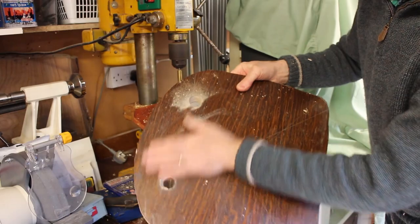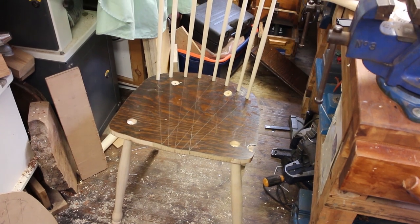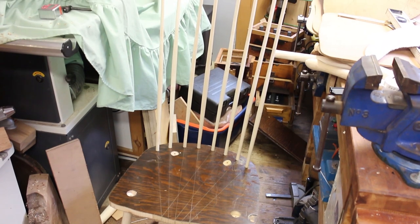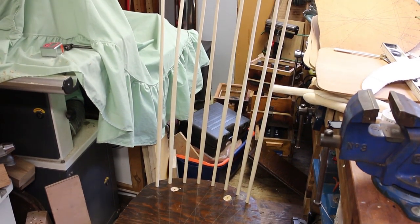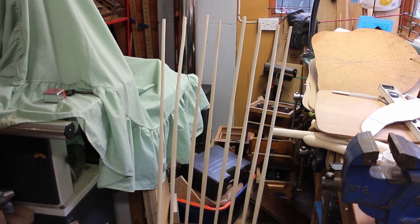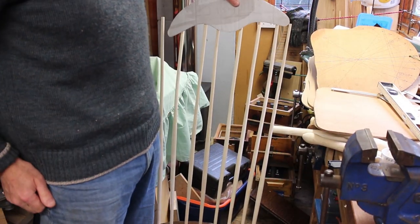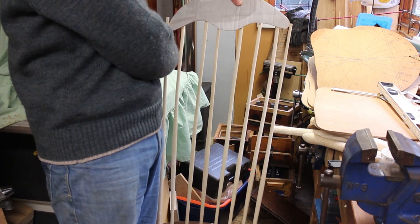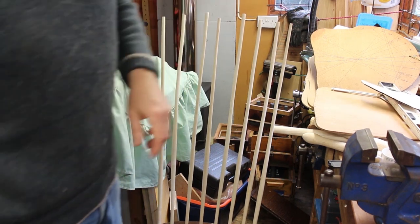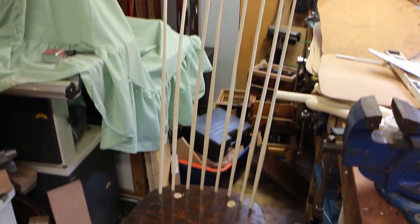That's the holes for my back legs done, hopefully both at the same sort of angle. I've now done a sort of mock-up with the seat just to make sure the leg angles are about right and also that the spindles are about right. I think that's working out quite well, so I'm fairly pleased. I'll try and position the comb so you can see what I mean. These spindles need a little bit of playing around and the comb will probably need some adjustment too, but that's the general idea. I'm quite pleased to have done that mock-up just to know I'm not going to waste a nice bit of elm.